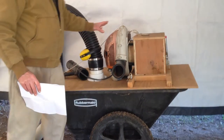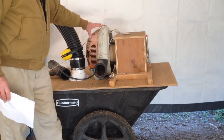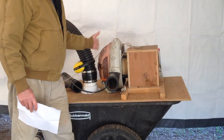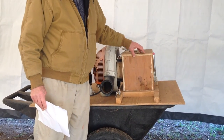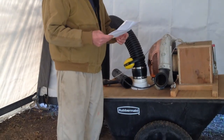The other change I'm going to make on the new version when I convert to aluminum: I called Stihl and they said this blower will run in any configuration. So I'm going to lay it down flat, right on top of the aluminum, and that will get rid of this plenum. That gets rid of a lot of potential air leaks and will just make the whole thing simpler. So we'll go run it now and you can see how it works.